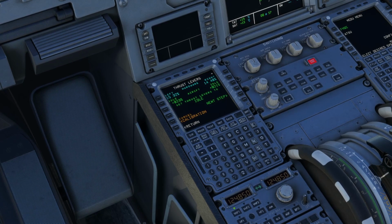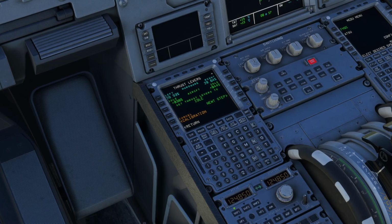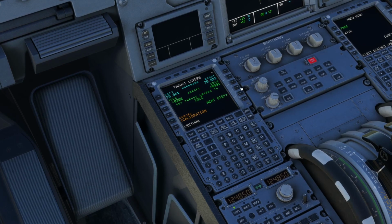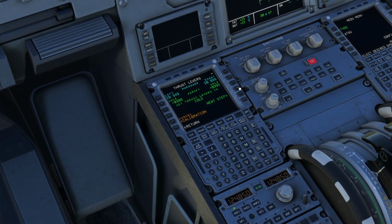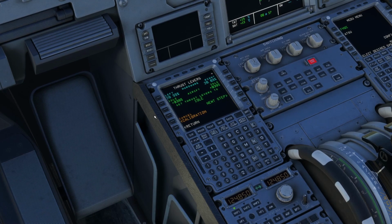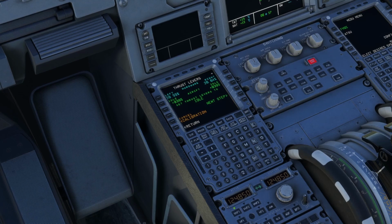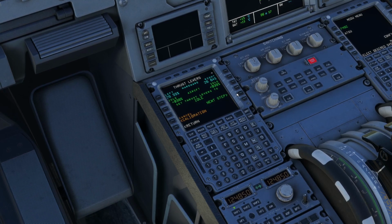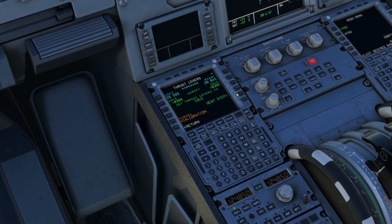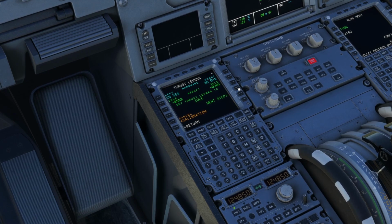Right, so let's move the levers to thrust idle, like so, and then press next step. Now you see on the screen I have slightly different values for the cyan indicators for the left and right, but just ensure that both levers are in the same physical position on the detents. Then we press next step.